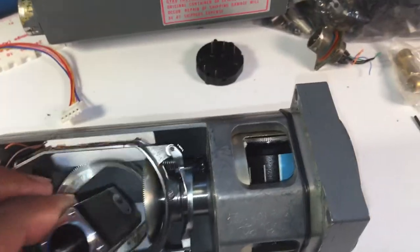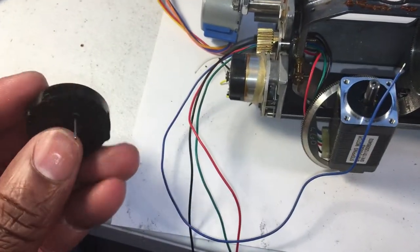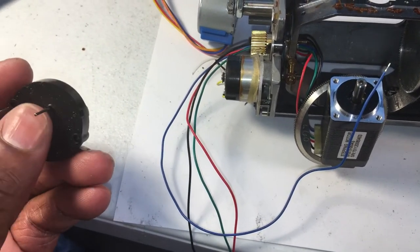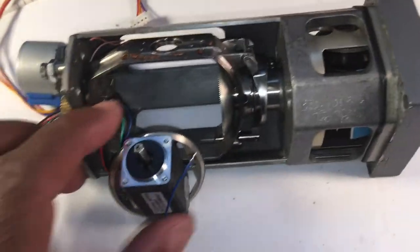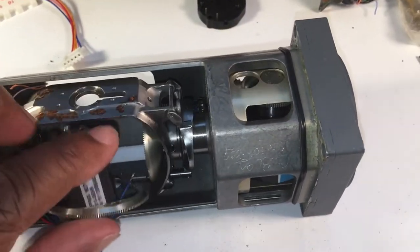So that's what we've done. Instead of using this stepper motor — it doesn't really have a lot of torque, it's good for aiming needles and pointers and things like that — this assembly might have been too much weight, so we decided to go with a larger stepper motor.